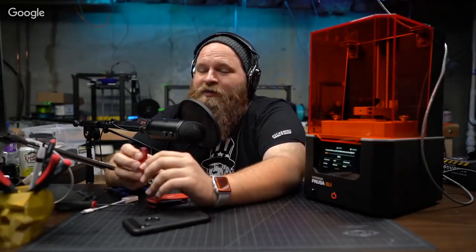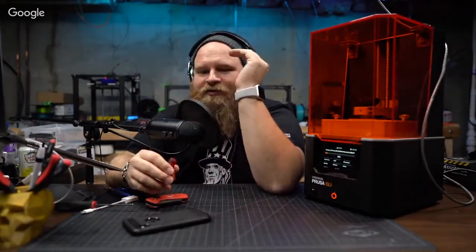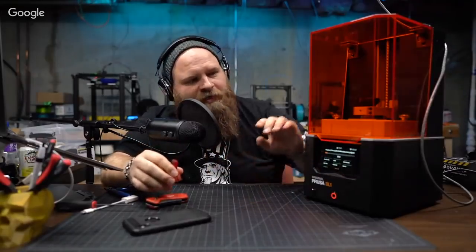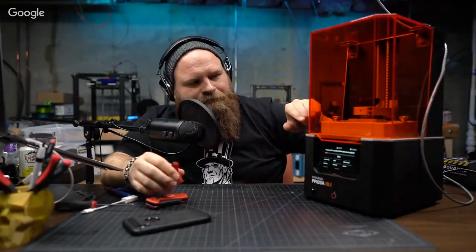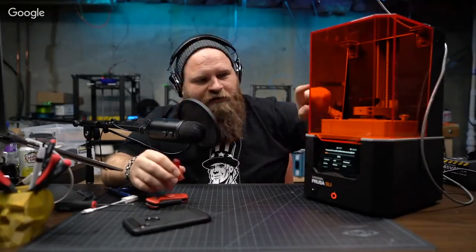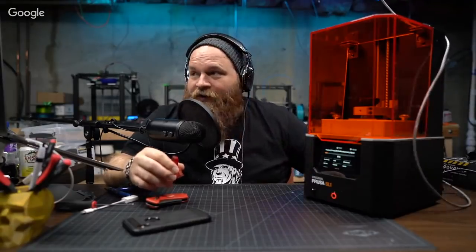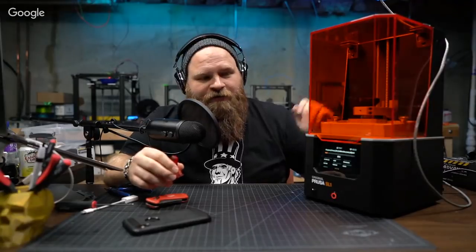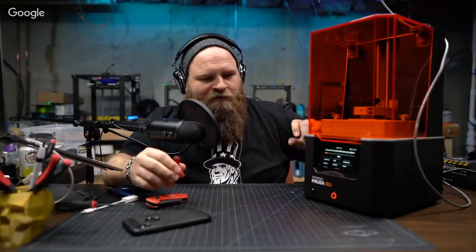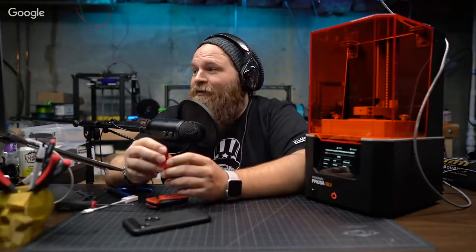I am not nose blind. I can smell it from here. It's when I get another foot away. It's about a 2 foot cone of smell, because what the Prusa system did was they took the air circulation and they trap it inside. So whatever air is in here goes inside the base, where it recirculates through a charcoal filter, and then some of it comes out the back. And fresh air is also inputted from the bottom. So it's constantly mixed with fresh air, a carbon filter, and then slowly pushed out the back. So, yeah, it's actually not bad.